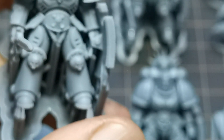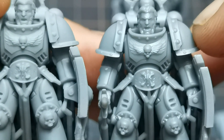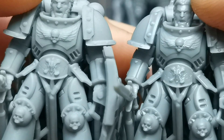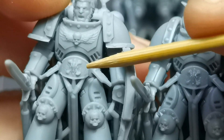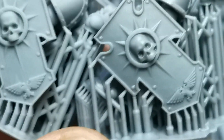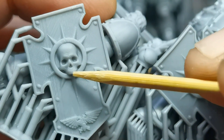Because I was quite curious, I assumed that Mono X has a stronger UV power. So I tried to print another mini on Mighty 4K but this time I raised the exposure to 2.2 seconds. Somehow the details on Mighty 4K are still more pronounced than on Mono X. The details on the skull at 2.2 second exposure on Mighty 4K are gone.